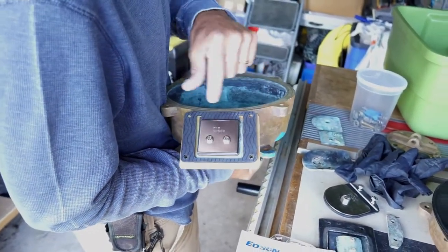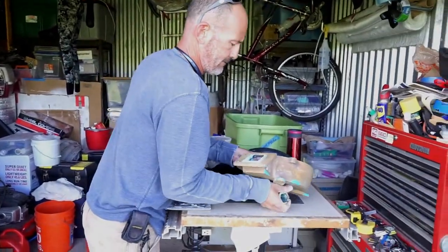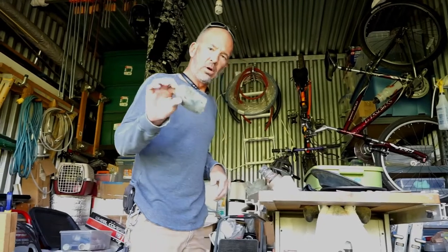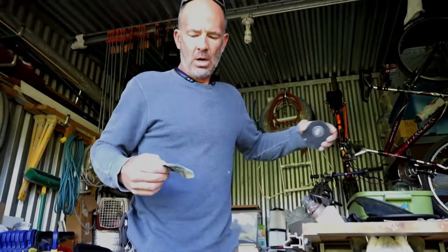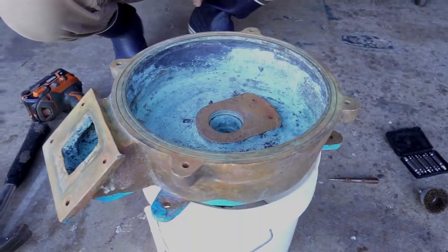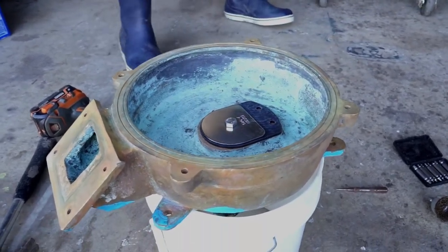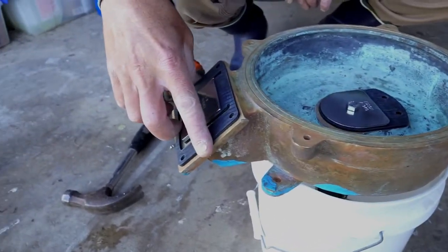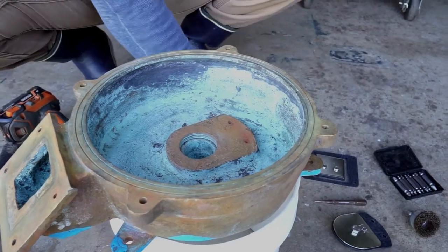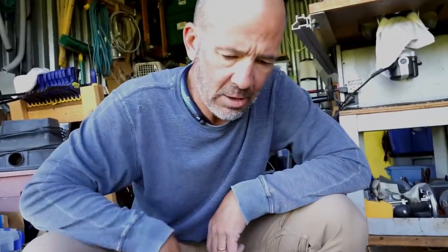We're going to have to do some customization. When we took the old parts off the bilge pump, all the flappers were shot — they weren't making a good seal and you couldn't pump anything with it. We bought the new Edson kit, but this is a replica of an Edson bilge pump. The diameter is the same and most of the rubber parts are similar, but where the bolt holes go for the mounting hardware and check valves don't line up exactly with the Taiwanese Grand Deer casting. These bolts just crumbled — they were probably red brass, not bronze, which is why they turned to powder.